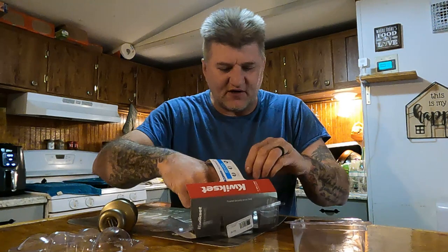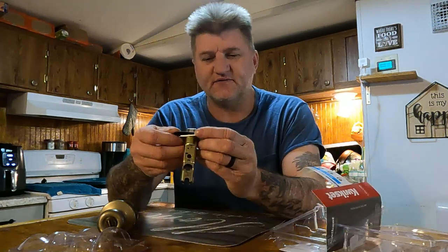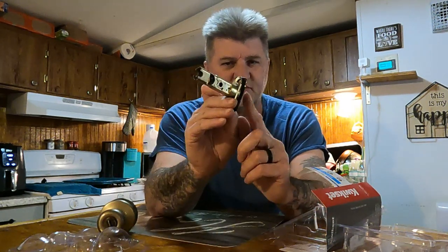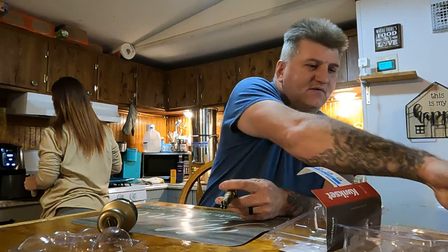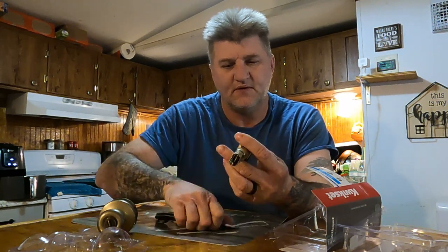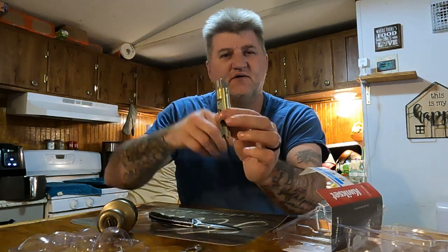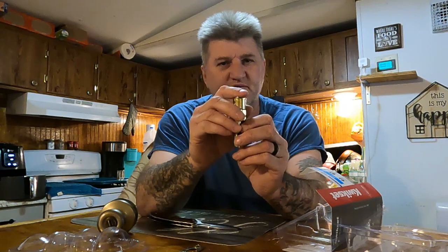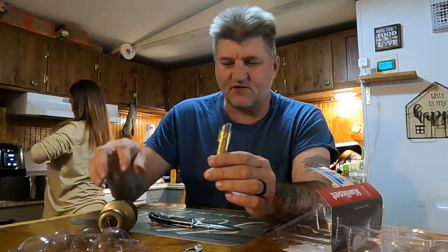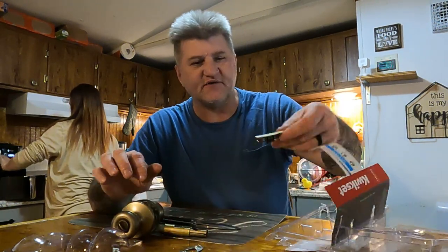The trick to these things is right here. When you buy this set, this piece goes inside the door and latches it — this is the latch assembly. The trick is to take and pry this apart, take this off, slide this piece off. Now you have a standard mobile home door type piece. These sets are like twelve to thirteen dollars for the cheap ones, and it comes with everything — even the new striker and screws.